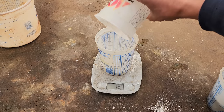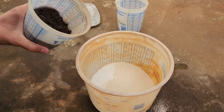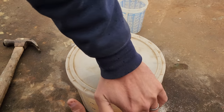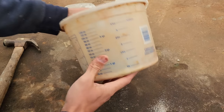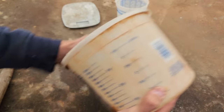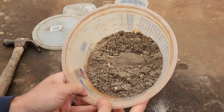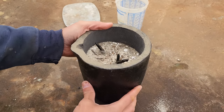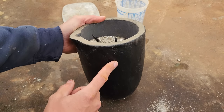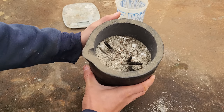So we'll end up with about 250 grams worth of silica total. Now we put in our material — our concentrates — put a lid on there, shake it up, mix it all up. Now it's ready to put in the furnace. I've got it transferred into a number 10 silicon carbide crucible. I really like these crucibles if you're going to do bigger production smelts. The fire clay just doesn't last — these last a long, long time.